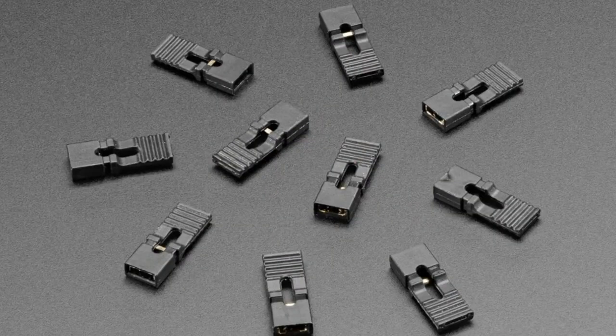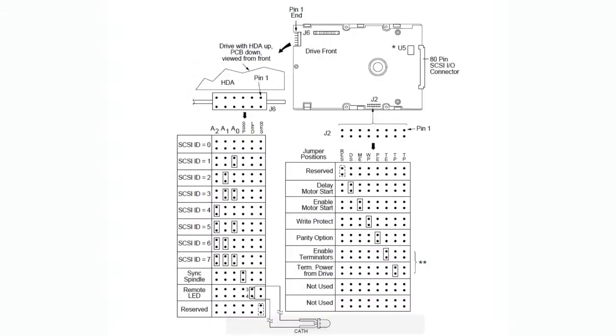So in the before times, when engineers had to have custom setups for their hardware, some configurable things, you didn't have an LCD, you didn't have a touchscreen, you didn't have a full keyboard maybe, but you did have jumpers. And if you remember, somebody who built a computer, you might remember having to set jumpers on your ISA Sound Blaster card to set the IRQ. Or this is really common if you have a SCSI drive, you would have to set the SCSI address on the back by putting in various jumpers, and then read/write speeds and whatnot. Jumpers are really annoying and they get lost. They're a penny a piece, but once they're lost you can't buy them at a hardware store, and people end up hoarding little bags of jumpers.